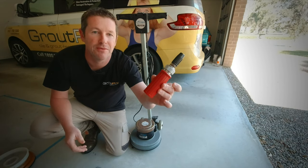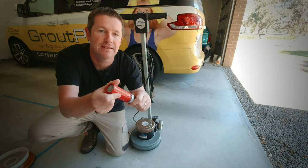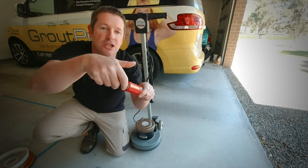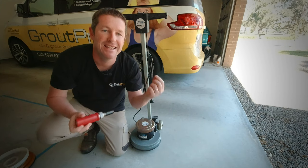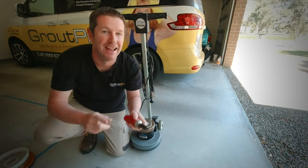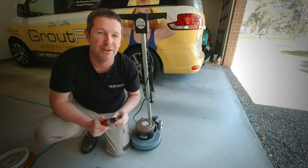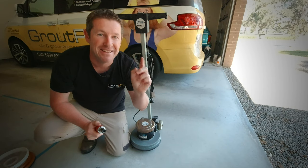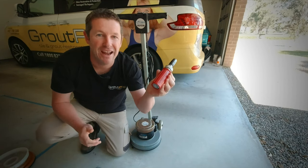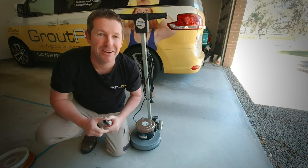I've also borrowed from my lovely neighbour across the road one of these impact screwdrivers — you put the corresponding bit into the end, place it onto the screw you're trying to loosen, and tap it with a hammer. It gives it a shock which should break the screw loose. However, given the fine head on these screws I'm still reluctant to use this. Bill, who owns this across the road, suggested we should try another method first, and that's what I'm going to give a crack at — it might just help you if you don't have an impact driver or don't want to damage the screw head.